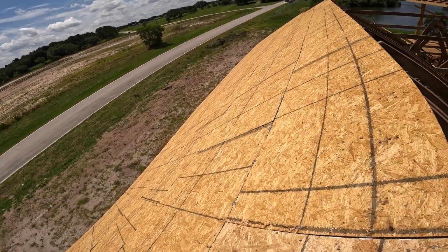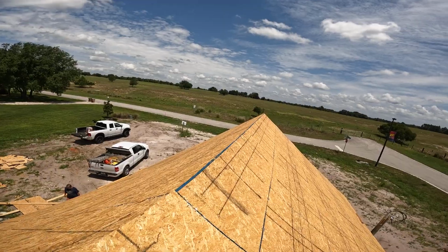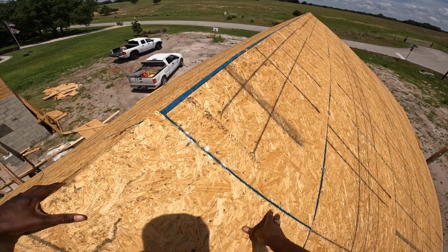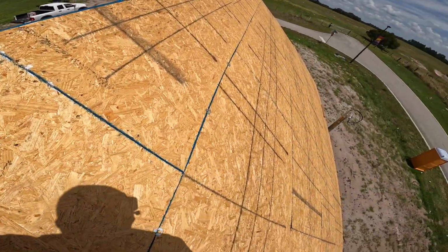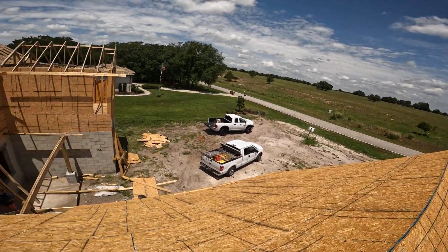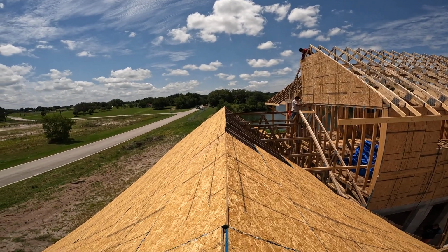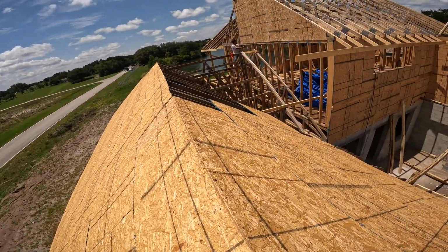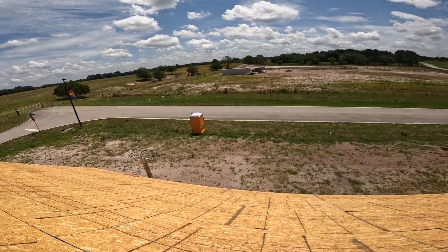So this is not a plywood problem. This is a rafter problem, installed incorrectly. You see the stress that's coming up in between the two pieces of plywood here because the rafter is sticking up. So you can stand here and even look down. We can see the bumps and the waves in the plywood, this whole side of this roof. So this one side is wrong.